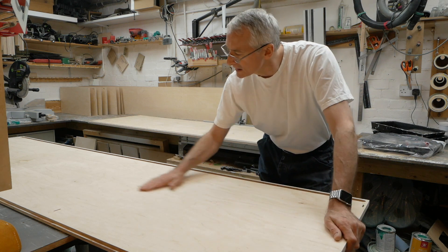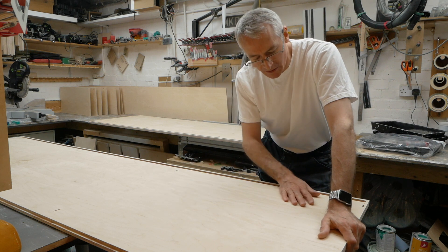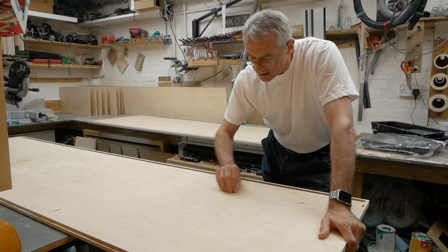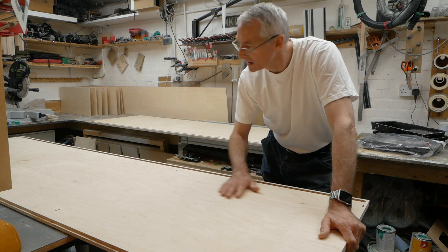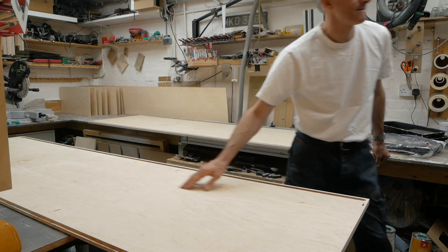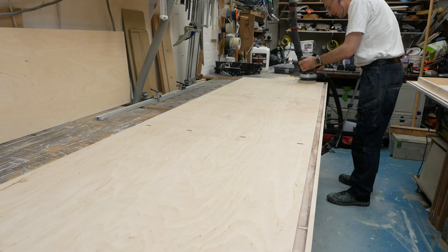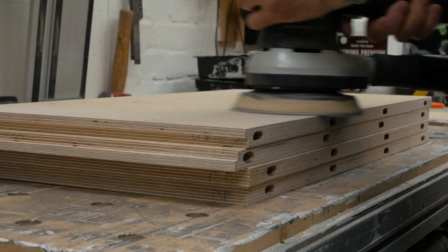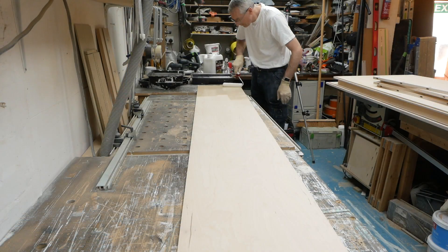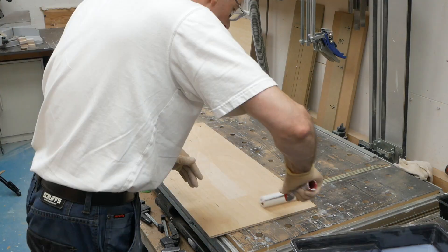This is all dried out nicely overnight, as you might expect - rough as a badger's backside. But we'll get a sander on this, get it smoothed out nicely and then maybe a finishing sander on it to de-nib it again with some P320. Then we get another coat on that and that should dry all together much happier. I'm starting with a P120 abrasive and working my way through the grits to P320 on all the components, paying special attention to the exposed edges of the plywood as I don't want any splintering at all in the finished workpiece. With everything cleaned up, I can get on with the next coat of water-based poly.